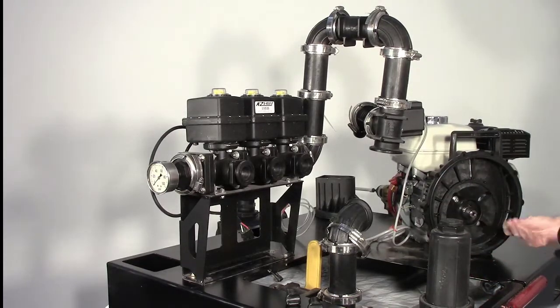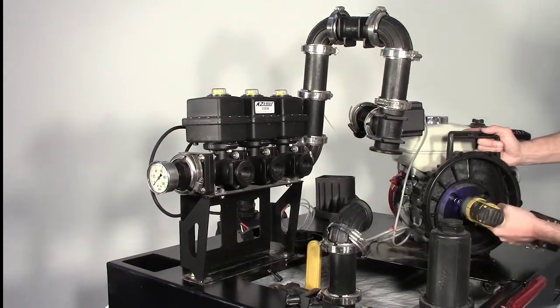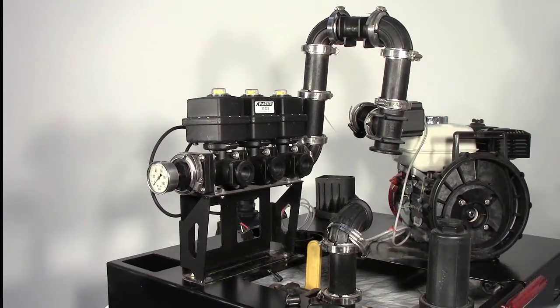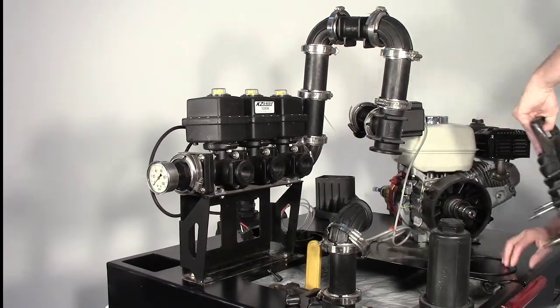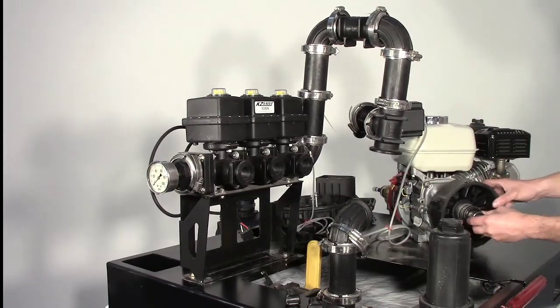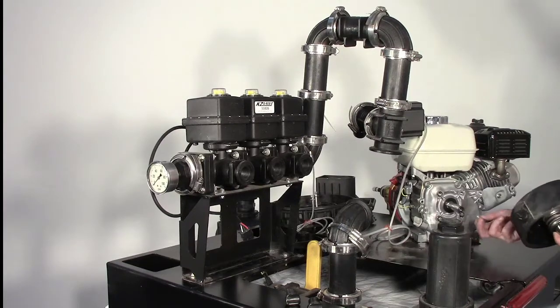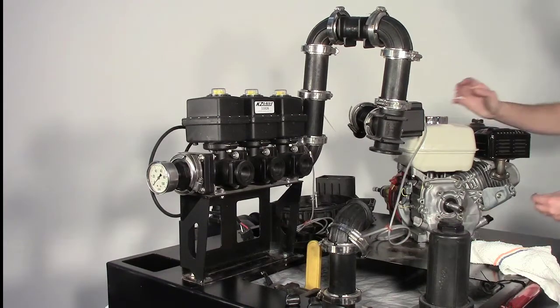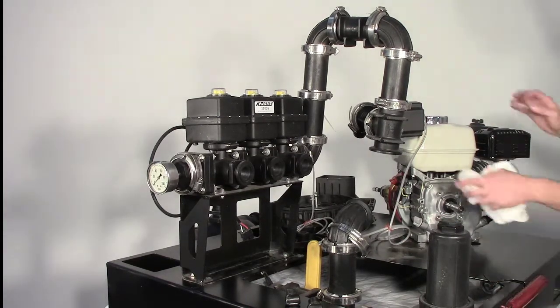Remove the 4 bracket screws, rear bracket washers, and screw head O-rings from the rear bracket using a 1/2 inch socket. Discard all hardware and O-rings. With the 4 bracket screws removed, the rear bracket and reservoir can now be removed from the drive unit. Discard the rear bracket, reservoir, intermediate shaft, and all O-rings.